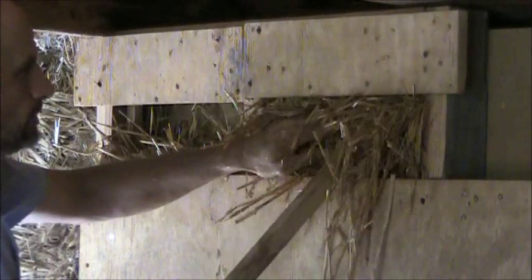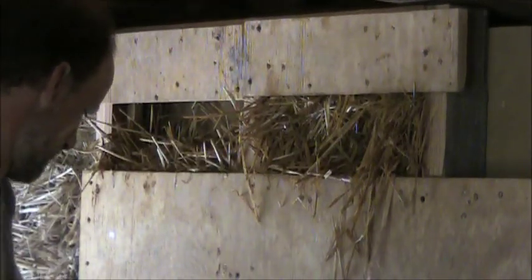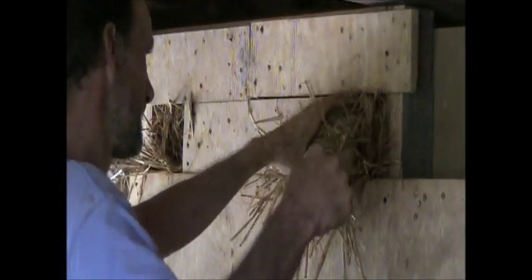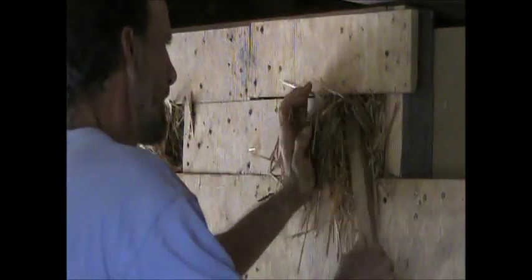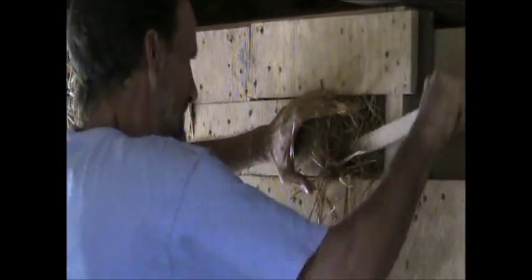What we found to do is put a form at the top of the wall and pack upwards. In this case I'm just using a small board and don't have to pack very far. If you leave a couple of voids at the top corners, they'll plaster and cover up fine, or you can put a little cob mix in them later. Once you've packed upwards, add another board to leave a small opening in the wall cavity — about a 6-inch space — then take the straw clay mix and pack it across the cavity, pushing all the way to the opposite stud and tying it into straw already packed above and below.